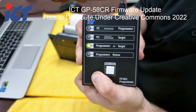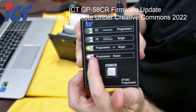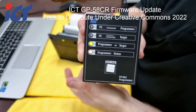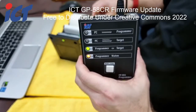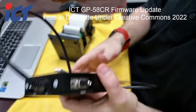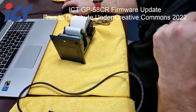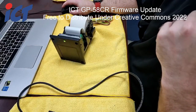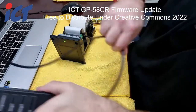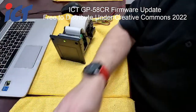Once the process is finished, your L4 light will turn off and then remain solid orange, and your printer will power cycle. Once this happens, you can unplug your FP001 programmer and then proceed to hook the printer back up to your computer and interface with the new smart printer tool. We'll go over that later in the video, but first we'll continue covering the rest of the programmers.